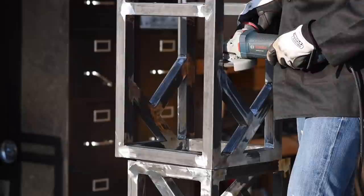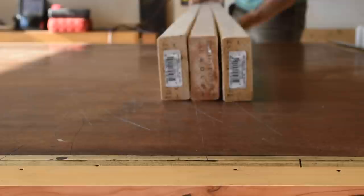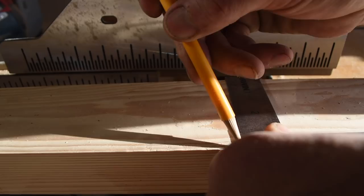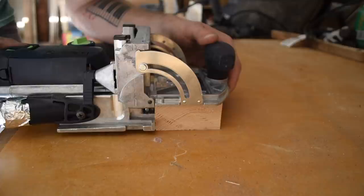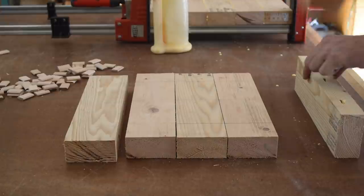With the three stools all welded together I moved on to building the seats, which are just made from 2x4s. Each seat is comprised of five boards that are 12 inches long and 3 inches wide — here I'm ripping that 2x4 down to 3 inches. Once all the 2x4s were ripped I marked them at 12 inches, set up a stop block and cut 15. You definitely don't need a domino to put these seats together, but I have one and it really helps keep everything aligned. You could just glue these up without any domino or biscuit — it would work just as well, you might just have to spend a little extra time flattening the boards.